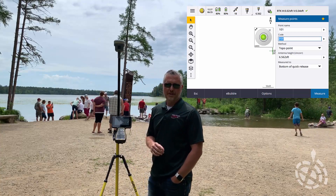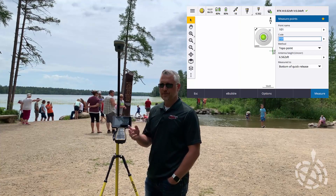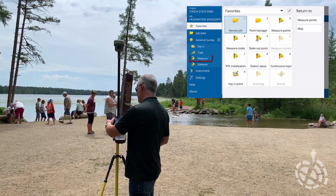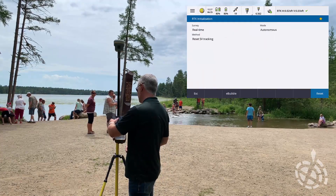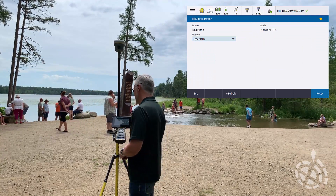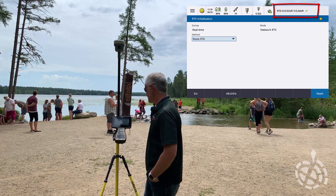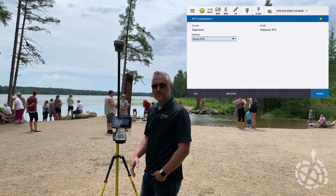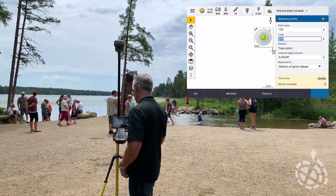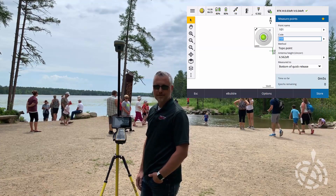Even though we're in an open scenario like this, doing the RTK reset is still extremely important, both in the open and in the treed canopy areas. You'll see me go ahead and hit the menu drop down, go under Measure, and go into RTK Initialization. It's already defaulting to the RTK reset. You just go ahead and hit reset. What I'm watching for are your precisions there in the top right corner — you can see the red X appear, then dial back down with the green check mark, letting you know you're within your precision base tolerances. Once I have that done, I usually like to go ahead and grab another shot, and that's what gives you your confidence when you're making those measurements.